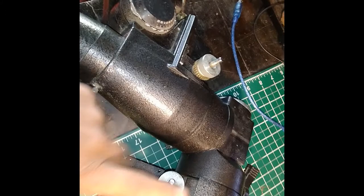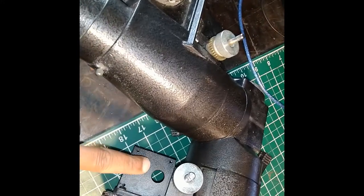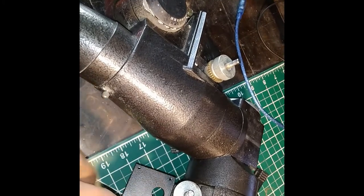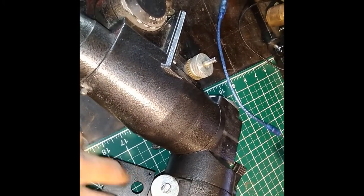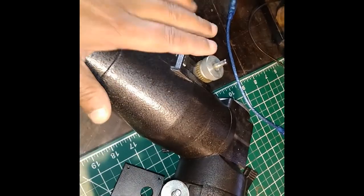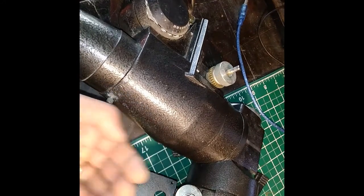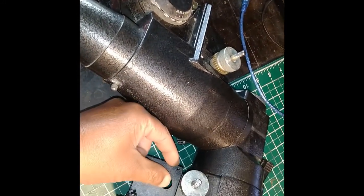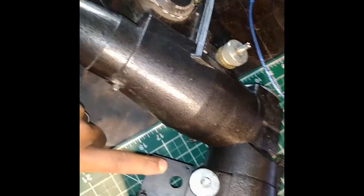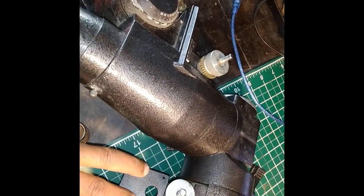To achieve that I needed precise position control of these gears. The original motors were just plain DC motors with a little gearbox, so I could turn both axes through the computer by applying voltages. But I couldn't achieve position control because there was no feedback from the motor to the computer telling me exactly how much it had turned.